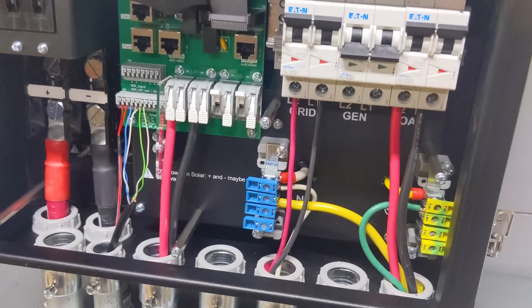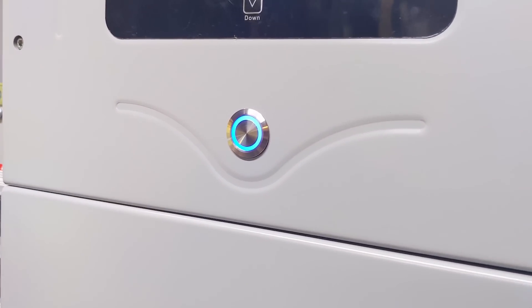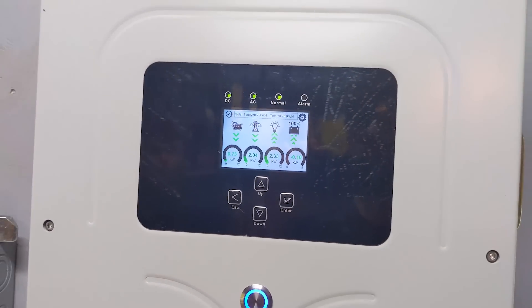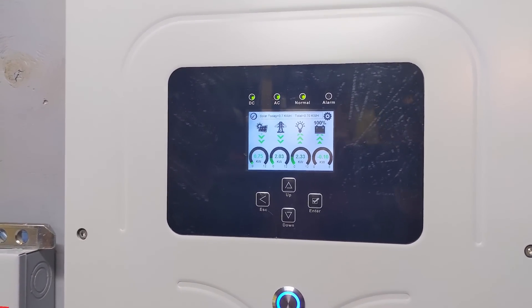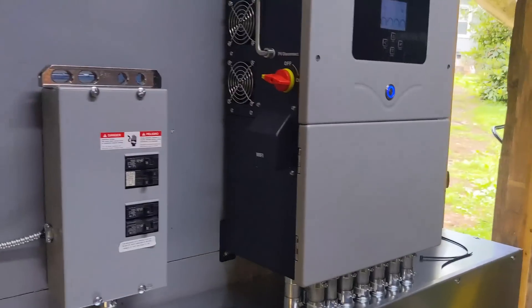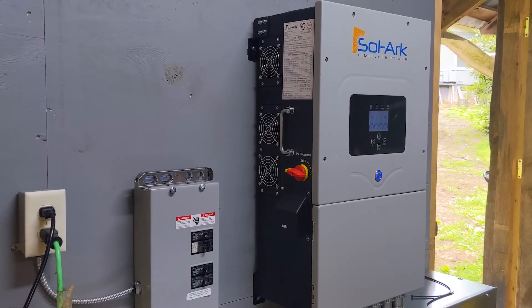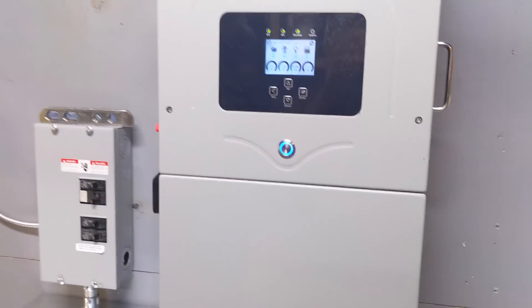We have everything hooked to this inverter except a generator — it's up and running and looks nice. We had a baseline of about one kilowatt and tried to run a 4,500-watt water heater. It gave an AC over-current fault, which is an ugly load, but Abraham will test that another day. That's pretty good for about half a day's work. If we can help you get a 5K for your house, a bug-out location, or a cabin, this is a great solution.